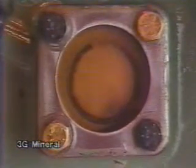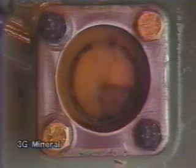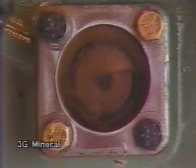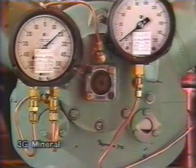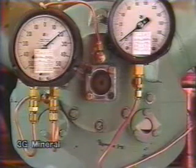Now it's starting to clear itself up. The oil is pulling in faster and faster and improving the oil pressure. It's still in a vacuum, and it has fully recovered its oil pressure. The little vortex at the one o'clock position is constant in this condition.